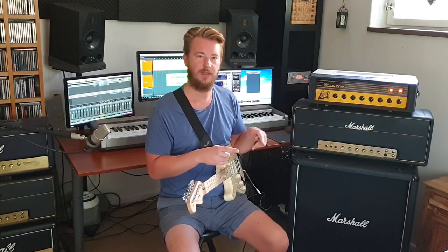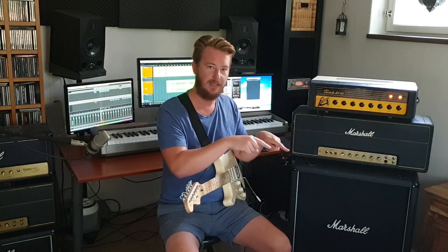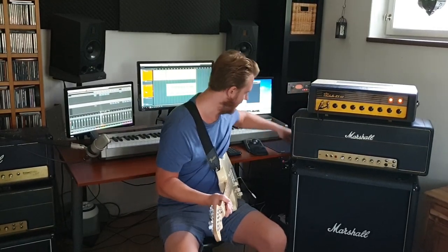It's not as much gain as if you would mod this to get the cascading gain, which I'm probably gonna try later on at some point. But it allows you to run both inputs in parallel, as opposed to just one side of the tube. You're not looping it back, so you're not getting a ton more gain, but just a little bit more. So let's see what happens. And of course, we're cranking everything. We'll see. All right.